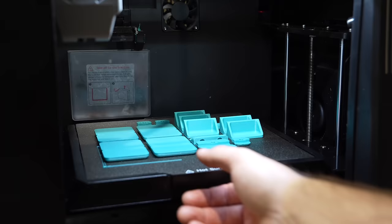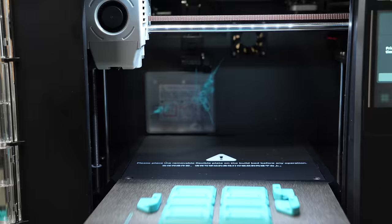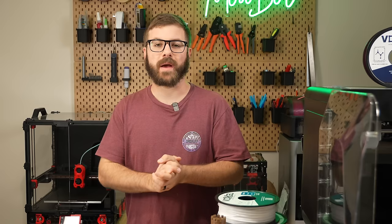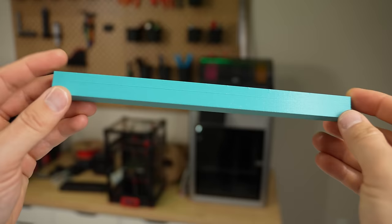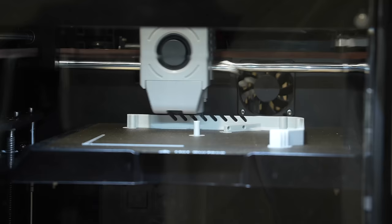As I was printing out parts for my underwire build, prints started off really nicely, but when a print finished I'd grab the hot plate, flex the parts off, and quickly start the next batch. Doing this, I noticed my first layer started to seem pretty inconsistent, and for just about every single print I was having to baby-step the nozzle a little higher or lower. It seemed like there was some thermal drift going on. I experimented with a few things and I think I've narrowed it down to being related to that chamber heater — printing without it gave me much more consistent results requiring little to no adjustments.